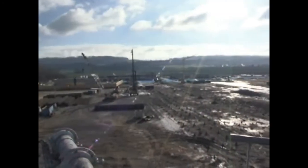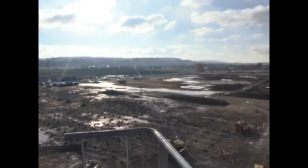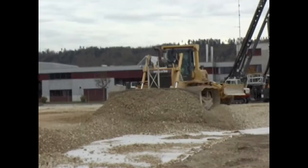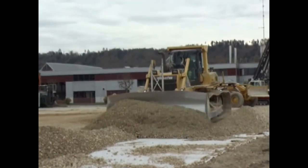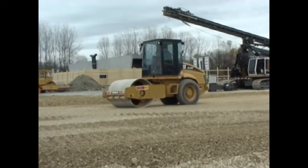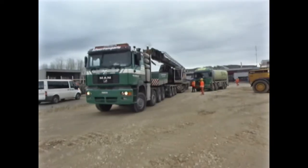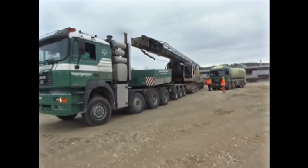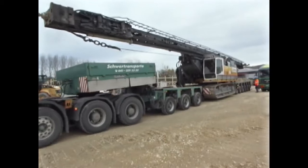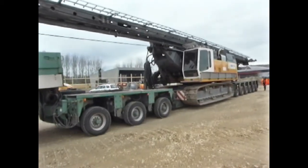For the construction of the new central office for Aldi Swiss AG in Domdidier, a 425-meter long and 200-meter wide building complex was created. The building site is located in a sensitive area, not only from a geotechnical point of view, but also with regard to soil mechanics. The foundation soil consists of young post-glacial sediments. Because of these difficult soil conditions, the foundation soil expert recommended to carry out extensive test loadings.